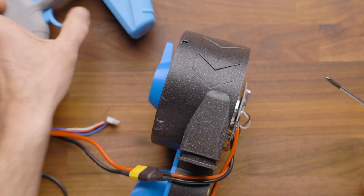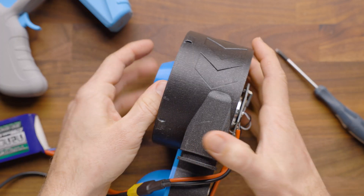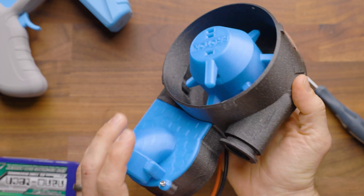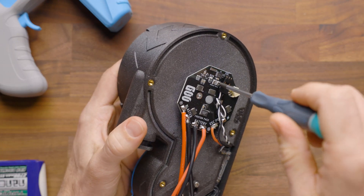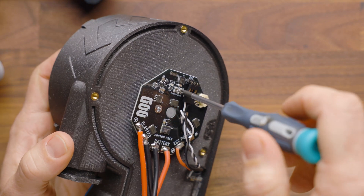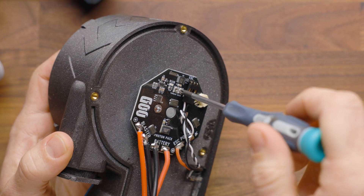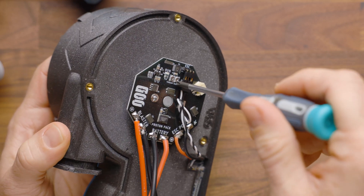So I'm just dialing it back. If both your fan and your auger are spinning and activating, then you are ready to go. Now, to adjust the actual fan speed, you're going to use the high. When this is in the left position — the farthest counterclockwise — that's the fastest position.